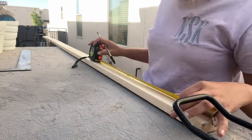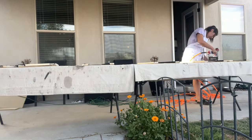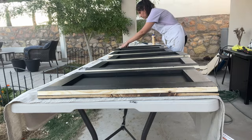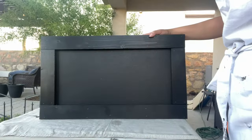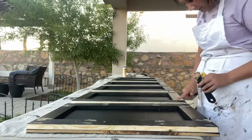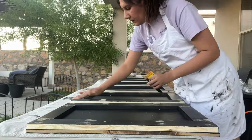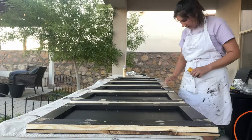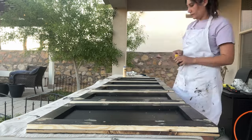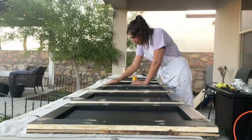After I cut all of the cabinet doors out, I went ahead and cut all of the frame pieces out of one by three, then painted everything. After the paint was dry, I attached it with wood glue and the brad nailer. For the cabinet doors, I used wood filler to fill in where the brad nails went in and also where the different pieces of wood met each other, so it would look really nice and seamless. To be honest, I don't really like how this ended up drying — you could still see the wood filler through the paint and I'm not happy about that. I'm going to try to give each cabinet door another coat or a couple more coats of paint to hopefully cover it up.